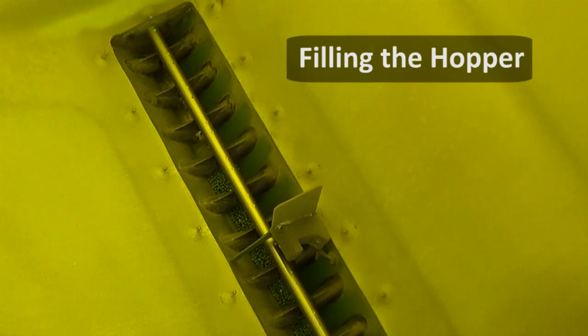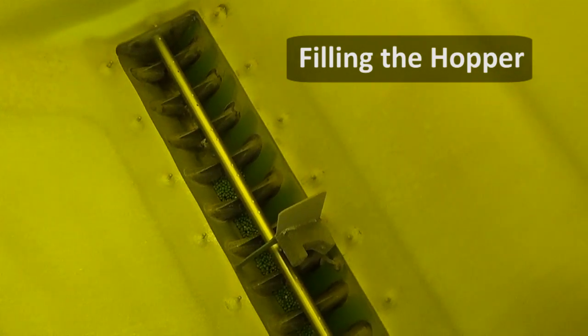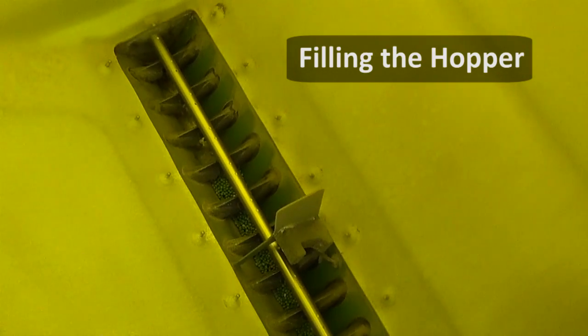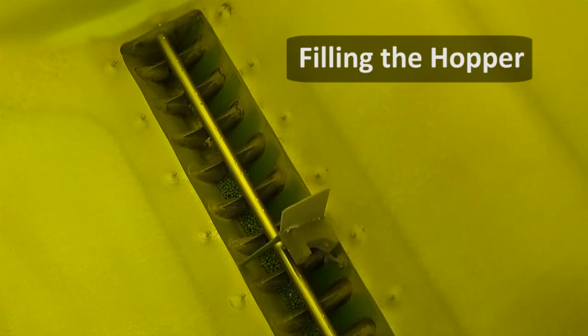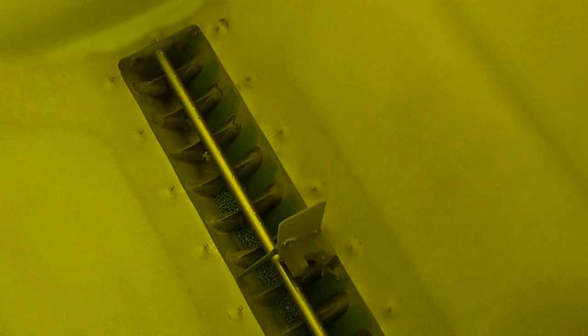Every time I fill up with high rate, I usually fill it up to about six inches of seed in the bottom and then I squirt graphite over the top of that, and then I'll dump more seed in and put my talc in with that seed, and it'll keep the flow ability going with it.